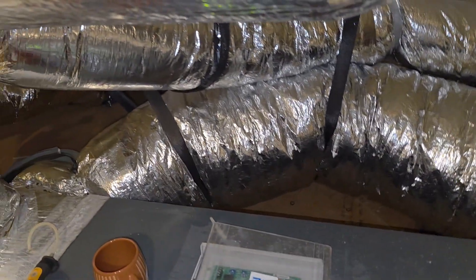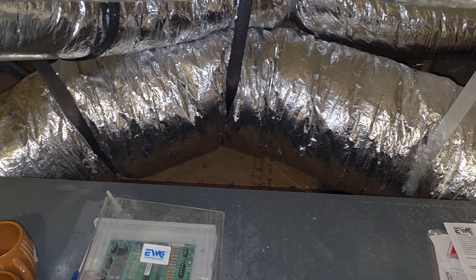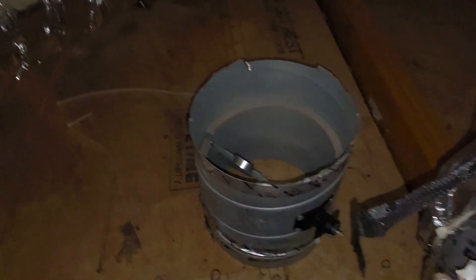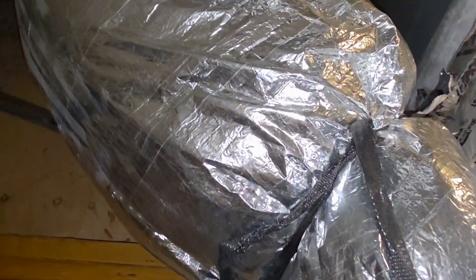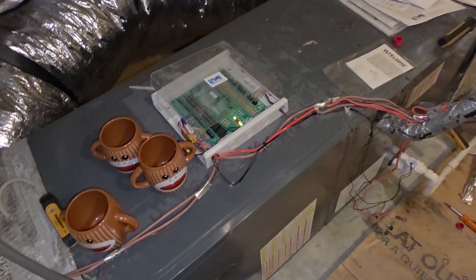There is a bypass damper issue — there's your bypass duct right there. Let me find the bypass damper; maybe it just hasn't been set up correctly. There it is — it's been unhooked because it broke. But don't worry, we don't need a bypass damper. They just took a nylon strap and choked the crap out of that duct and called it a day.